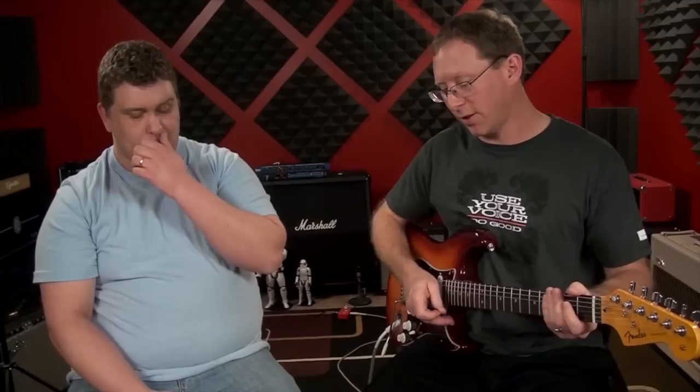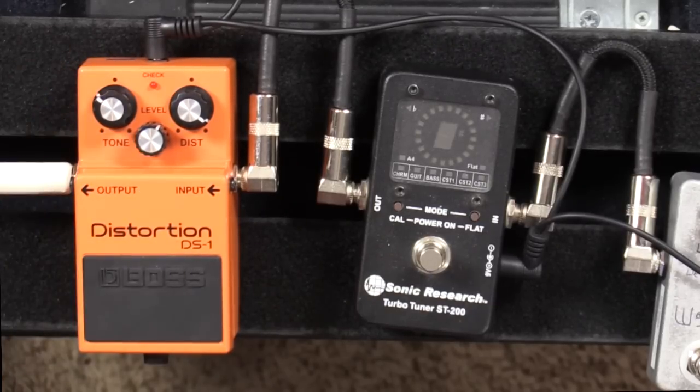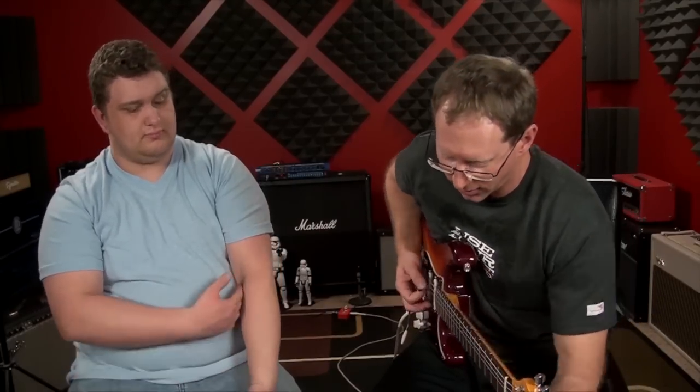But let's just say for all the DIY guys, you have a transistor that's boosting signal into an op amp that's then clipping to ground. Okay? Cool. And then it borrows the famous Big Muff Pi type of tone control. So which is why, like on a Big Muff, as you turn it down, you get into the meaty territory. A lot of guys, their amp's a little dark, so it's a little brighter right now. A lot of guys usually run a stock one, like 10 o'clock or something. Anything above that kind of gets a little bit shrill. But anyways, less talking, more playing.